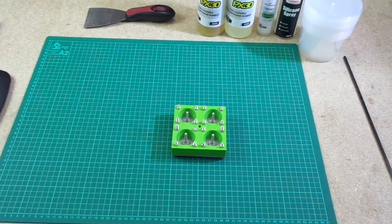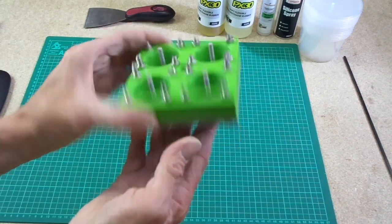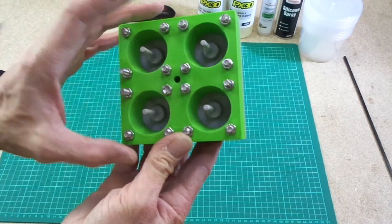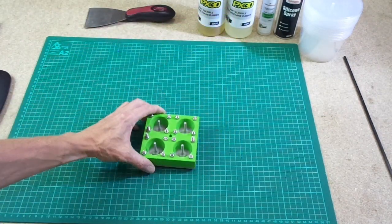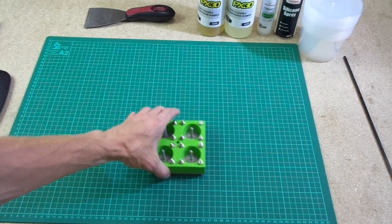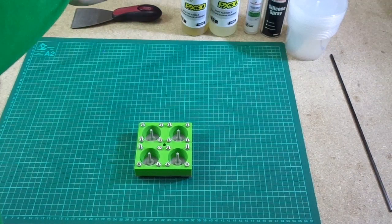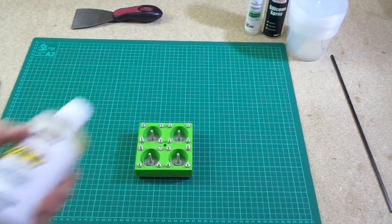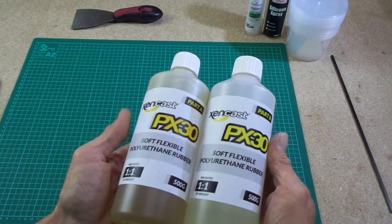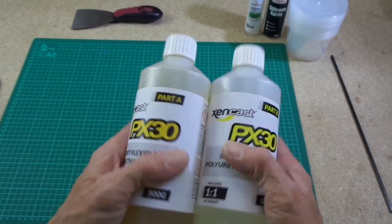So this has been bolted and clamped together with some M5 cap heads, not excessively tight, just tight enough to hold it together. I have sanded this and cleaned it up and got this ready, and basically all I'm going to use, guys, is this stuff. So it's a two-part mix, polyurethane resin rubber, and you mix it by weight